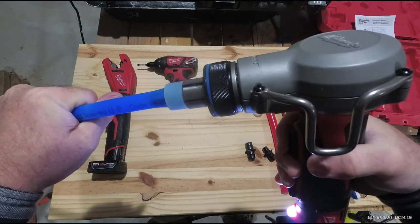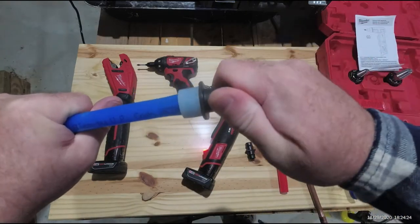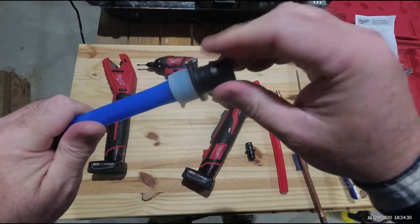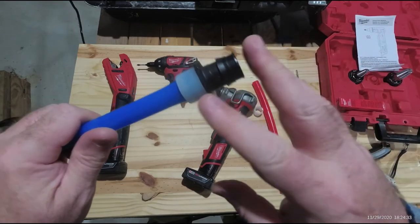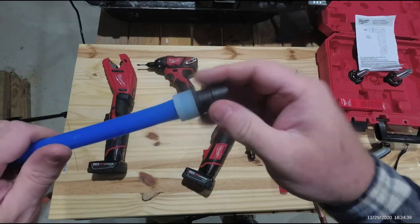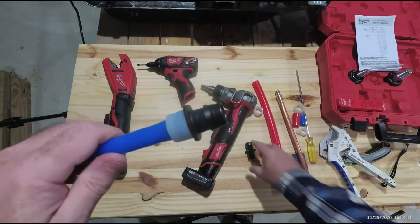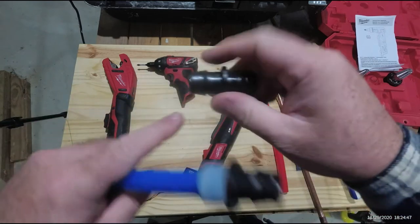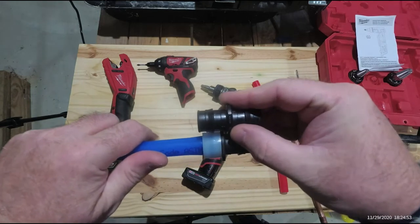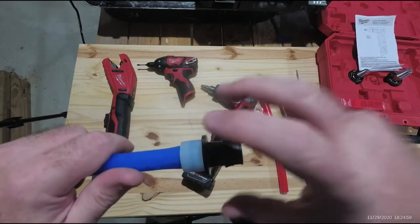On this half-inch it just takes a few expansions. Then you take your fitting, put it inside until it bottoms out, and in a few minutes you won't even be able to turn it — it tightens up really fast. Initially it shrinks to around 1,500 pounds of clamping force. You can also notice it's turning blue right here in the center, which means when you bottom it out this raised shoulder will be dead center inside that ring.